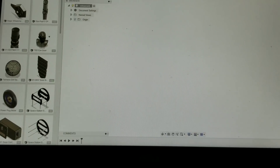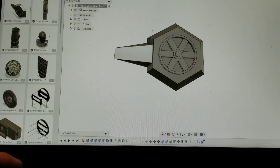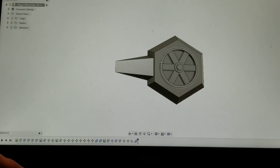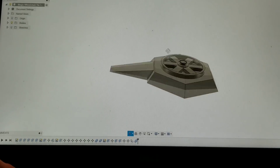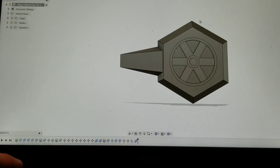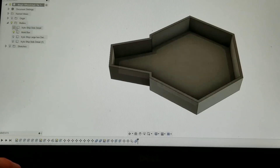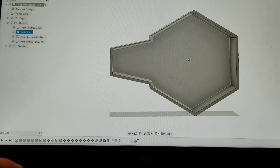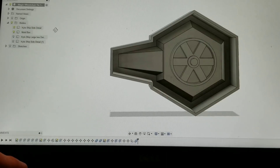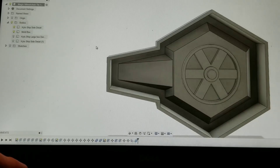Let me show you how I set this up. We'll go over to Fusion 360 now. Alright guys, so we are here in Fusion 360 — I'm going to talk a little quiet because people are asleep. Here's the part. It's really simple as you can see. Flat bottom — maybe like a 10-minute model, maybe less. And what I did is created this box. I'll turn the part off so you can see what it is — it's just a floor and then the walls. You can notice it's kind of shaped like the actual part, which is done to save silicone, because if it was just a big rectangular box it would use much, much more material.